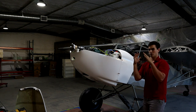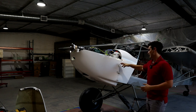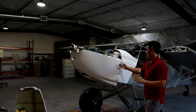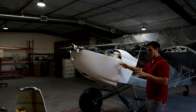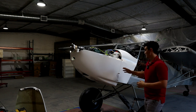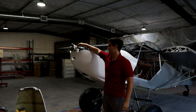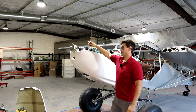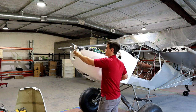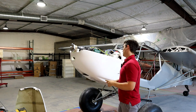The back edge always has to be trimmed and it depends on how far forward or backward you move the cowling — the profile wraps differently depending on position. There's an optimal zone, and the cowling is happiest when it's protruding from the front plate of the engine about an inch and a half. That's why you need the prop spacer — there's no way of knowing how far forward to go without a prop mount and spacer.